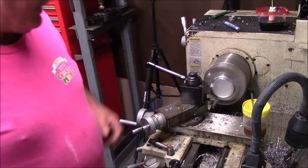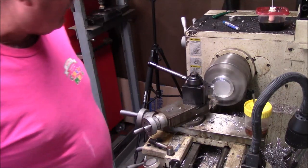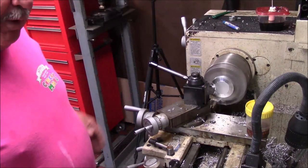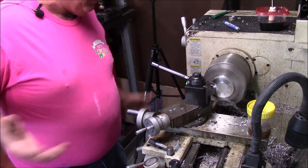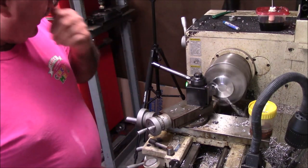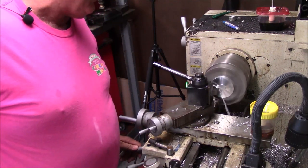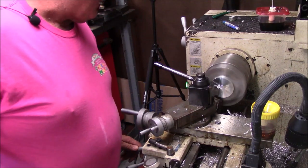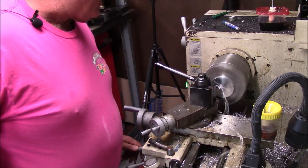I'm using a plastic coaster that I have as a kind of guide to basically get the basic shape I'm looking for. I'm doing this in steps. The OD wasn't critically important, but it's important enough to be close to the right size. Basically what I did is clean up the part earlier, then I sawed it, and now I'm facing them. I took the narrowest one I had and I'm still going to be about 20 thousandths larger than I need, so it's imperative to get these within a couple of thousandths because of the way I'm making them in a production run.